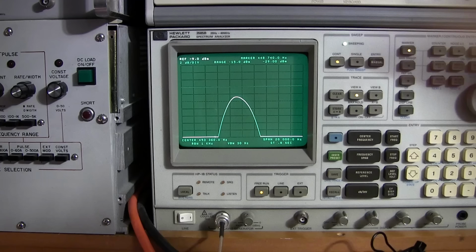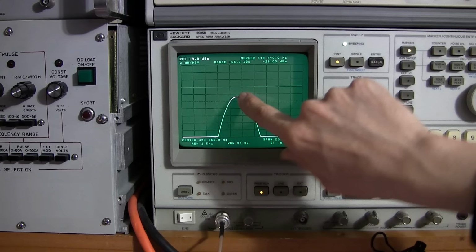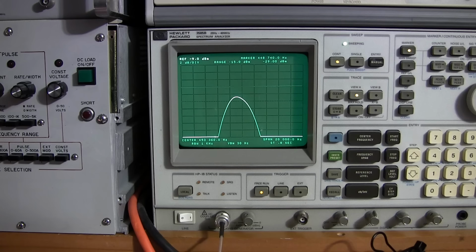The difference, if you're listening to a nice AM broadcast signal, between the center line and what you see here will be virtually unnoticeable. So again, if you're trying to really dig a signal out of the mud here, you're going to want to have this in the manual position. And you can see it just centers up. And then of course, if we use the crystal selectivity at this, we can see the crystal selectivity is exactly where the IF center is. And that's what you want. So keep in mind, the AVC does move.